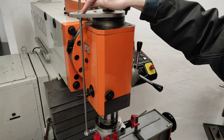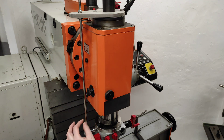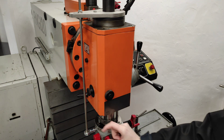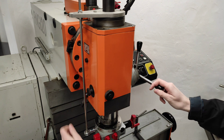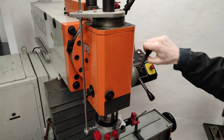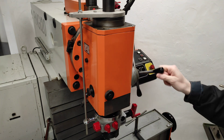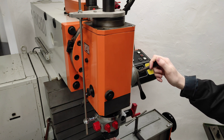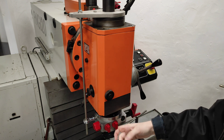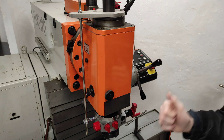The rod or shaft will be bolted to the plate, and this rod will be bolted at the bottom so it can move like so. This way I have the full travel on the quill and I have nothing in the way, so I can move the head or table in all directions and it won't hit anything. So let's make that.